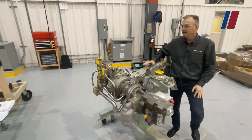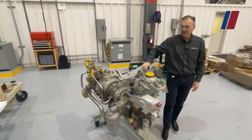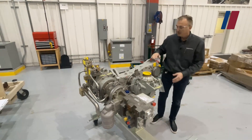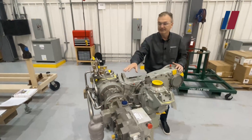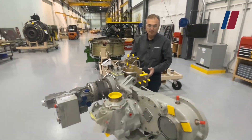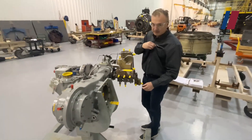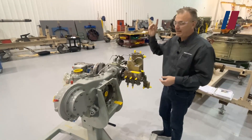This is the AGB, the accessory gearbox, mounted at six o'clock on the air collector underneath the HPC. It is connected to the HPC via this transfer gearbox, which converts a 90-degree rotation to an axial rotation using bevel gears. The AGB's longer case has spur gears separated by idle gears to connect accessories such as the hydraulic control pump, the lube and scavenge pump, and the starter. There is also a bracket where you can remove a cover, connect a drive, and rotate the HPC compressor during a bore scope inspection.